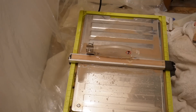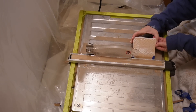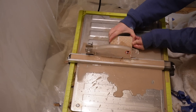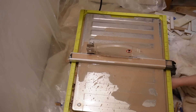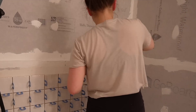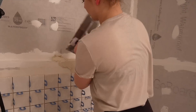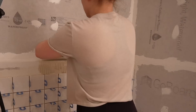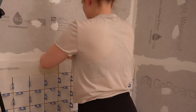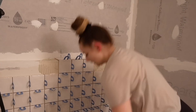Then I needed to cut tiles at a 45-degree bevel for the shower ledge. You can buy special tools for this, but I just put some painter's tape on, held the tile at 45 degrees, and used my normal wet tile saw — and honestly, it worked out really well. I'm so happy I ended up doing this shower ledge; it was a happy accident because it turned out so cool and will be extremely functional. I have a lot of shower products, so I needed somewhere to store them, and this was the perfect solution.